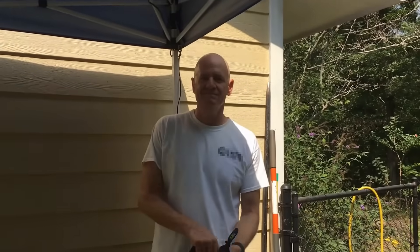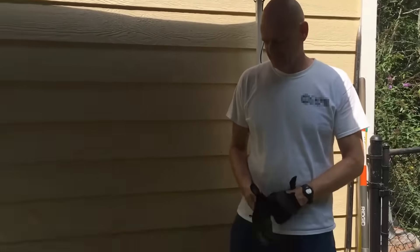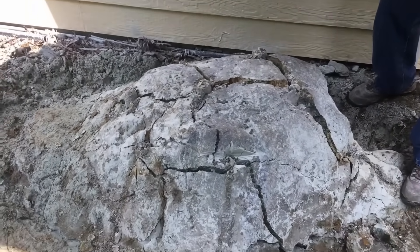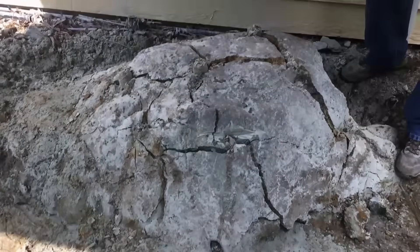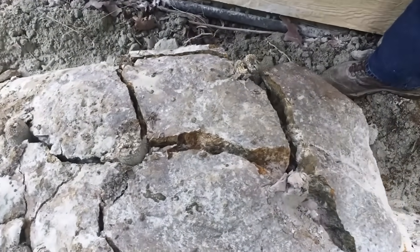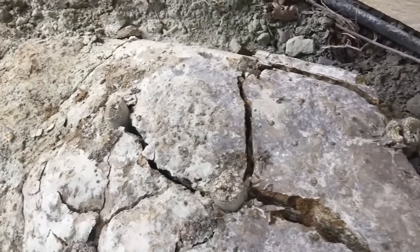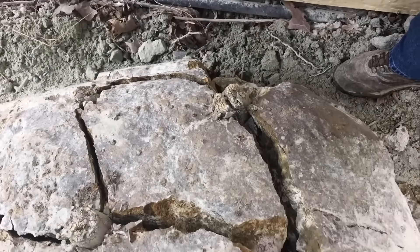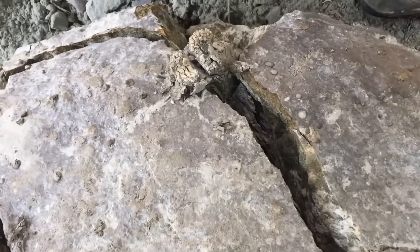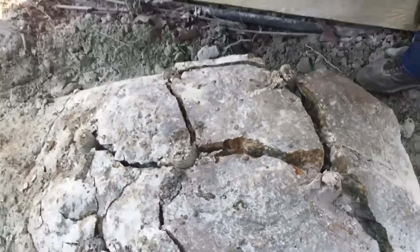We are at Stone Mountain Jr. There's this rock here — that rock that's been sitting behind the garage for a long time. We decided to get the chemical rock-breaking stuff, drilled holes in it, and put it in yesterday about this time since it takes 24 hours. This is what it did in 24 hours. The time-lapse shows a nice progression from no cracks for about 5 and a half hours, to tiny cracks, to these big cracks 24 hours later.